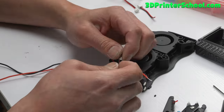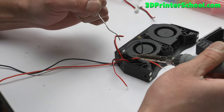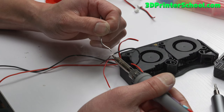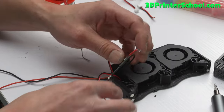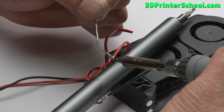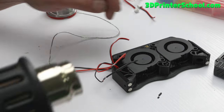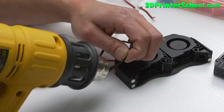Wrap the small wire around the bigger wire, then apply solder from the top. I'm going to hold it from the top and put the solder on top of the two wires — that's a very tight connection. Do the other side the same way, going in from the bottom at a slight angle if it doesn't melt right away. Once both sides are soldered, slide the heat shrink over and apply heat — boom, done.